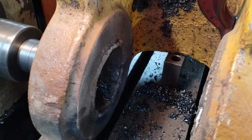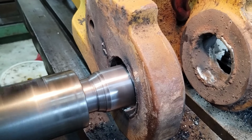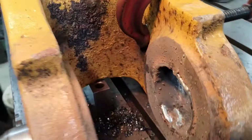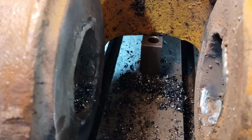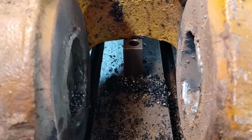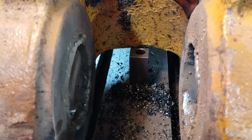Got the first round of welding up done, and I haven't changed the setting on the cutter at all. I'm just buzzing back through there, seeing what that does once. See a few sparks. It's all that bits of spatter that stick themselves in there. They chill really fast and get hard. First pass through after a touch-up job like this is always really hard on the cutter. It'll be pretty well wiped out after this pass.